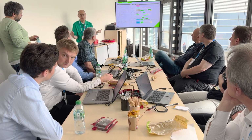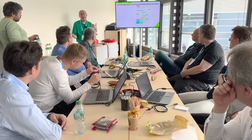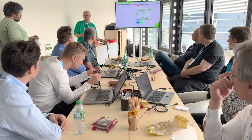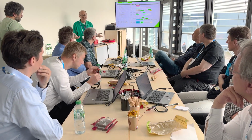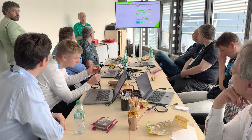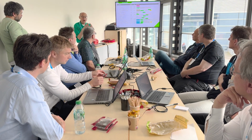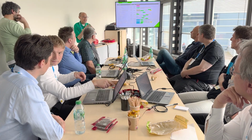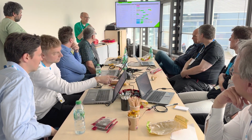So rather than just, okay, this pin is high and I'm transmitting it, you can decide, oh, that pin is high, I'm going to do something about it. I'm going to make this other pin low and activate the fan. Temperature is too high or it's been too high for too long. Really sophisticated stuff that you're able to do with the onboard processing. The XBee's onboard processing is really good, but it is somewhat resource limited. It is not a complete computer system. So